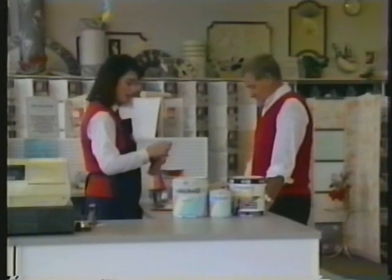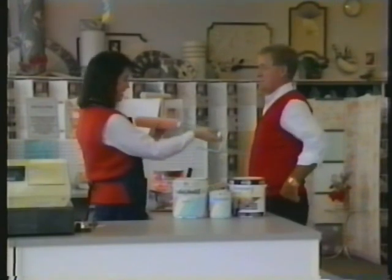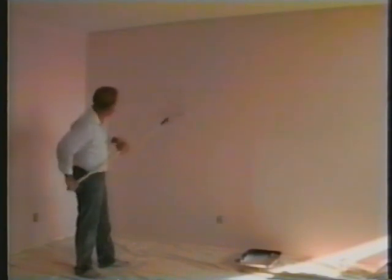Use with alkyd paints. A nylon brush may be used with latex paints, or a polyester brush can be used with both alkyd and latex paints. As with brushes, select only top quality rollers and roller refills. The best roller frame to paint with has 4 or 5 sturdy wires that support the roller refill across the entire length to keep each roller stroke smooth and even.